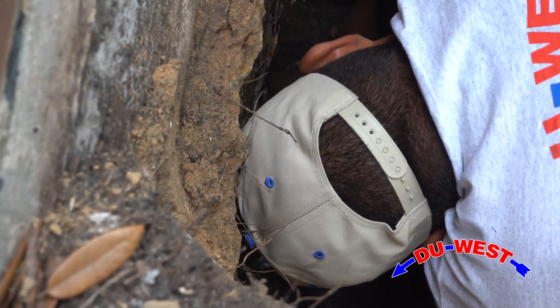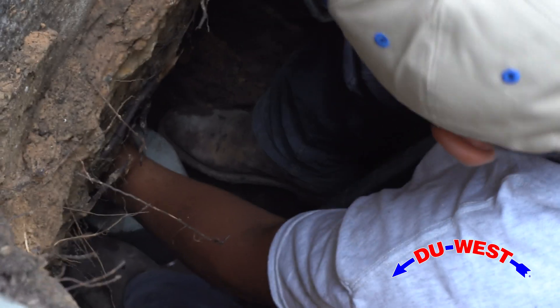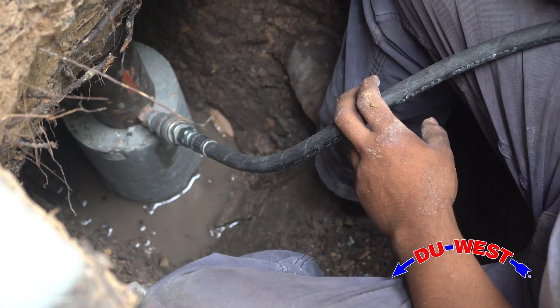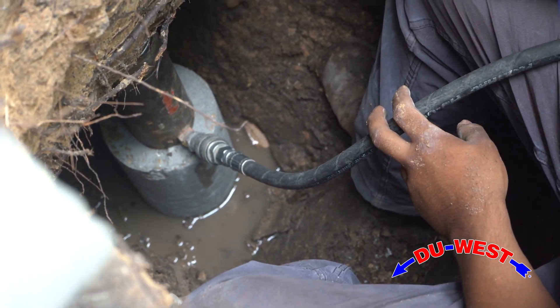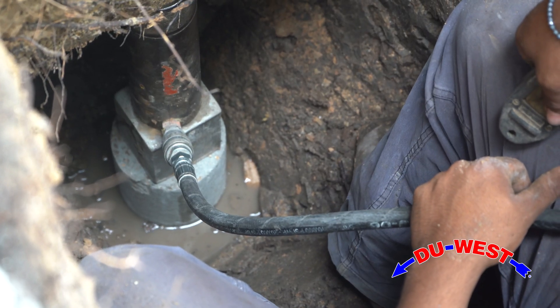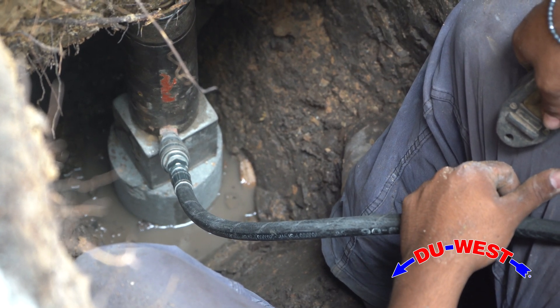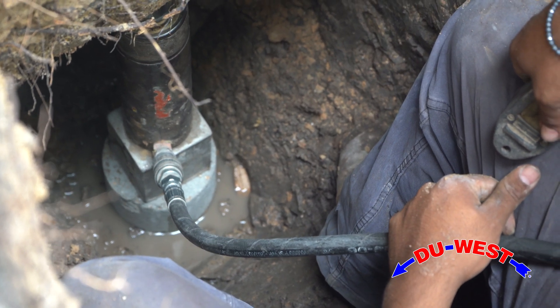Set it in the hole as though you're going to pick the house up, set your jack on top, and start driving. You see the water in the bottom? That's critical because not only does it lubricate, but it softens the soil and helps the pile go deeper in the ground — and the depth is everything. Now you see that aluminum pad? That's to drive the pile a little bit further into the ground so you can set the next cylinder on top.